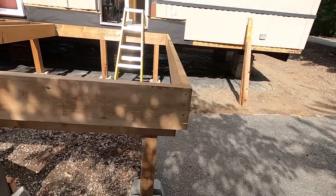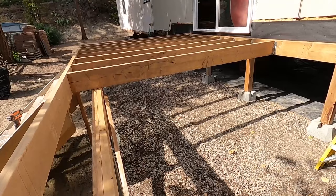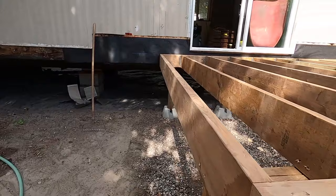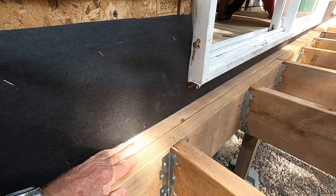Let's get into the technical parts of how I'm building this deck. I'm using two-by-eight floor joists and two-by-eights for my beams. This is all pressure-treated material for outdoor use. This particular material is treated with a brown stain, and I'll be putting that same five-quarter decking material on top.